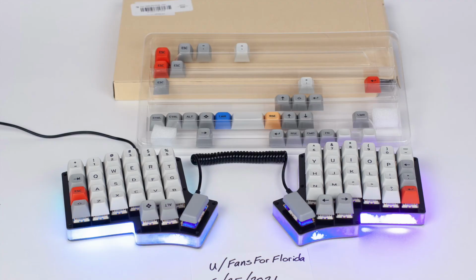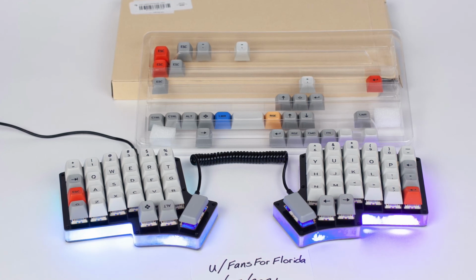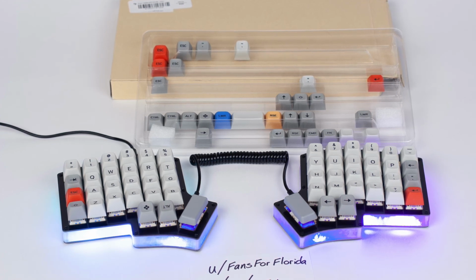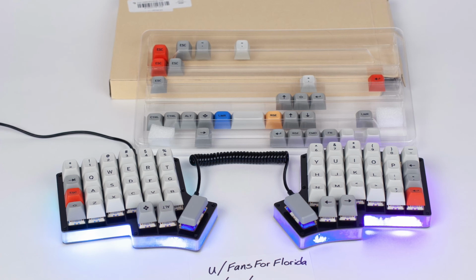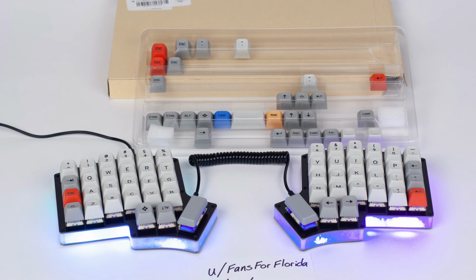I eventually built a Keebio Iris keyboard, which I liked a lot. I borrowed a lot of my key layout from the ErgoDox, so the enter key is at the bottom right, the dual function escape and control key is next to A, and of course the equals key is at the top left. It only has one set of thumb keys, so I lost that function key on the thumb cluster. So instead, I made a couple of keys dual function. For example, holding left space accessed a layer with my navigation keys on my right hand.